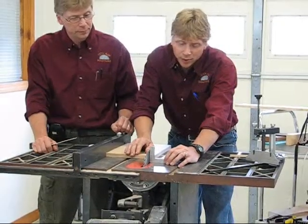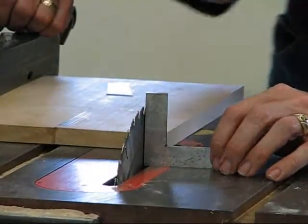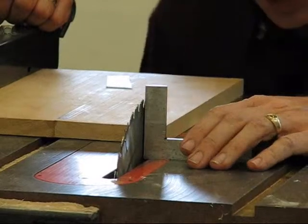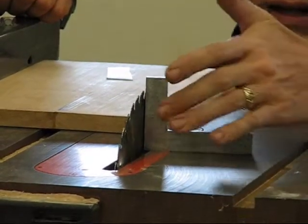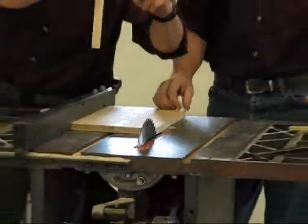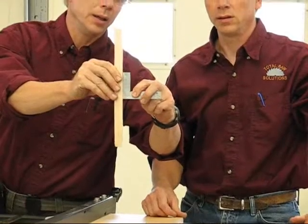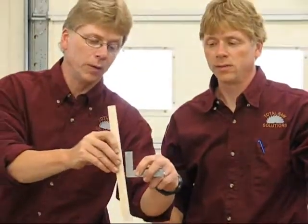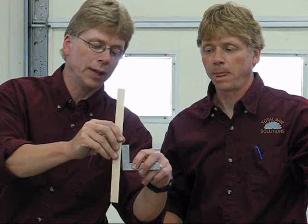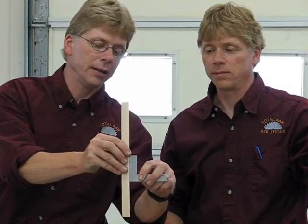As I put the square against the blade, you want to put it between the two tips. As I look through, you want to have either a light source, a piece of paper, or something so you can eyeball and look down there. You crank your handles in until everything is dark. Once it's dark, you know you're lined up correctly. If there's a little gap when it's parked, that means we have to make an alignment.